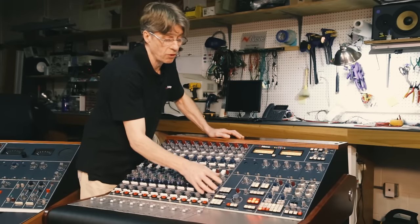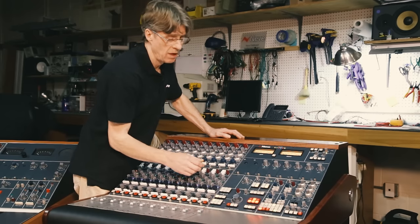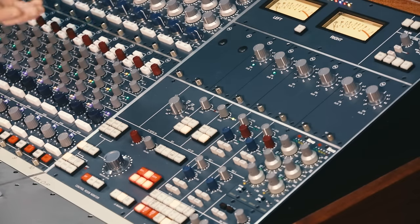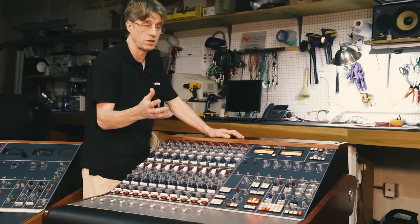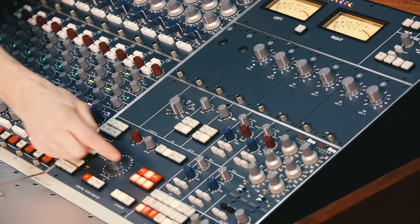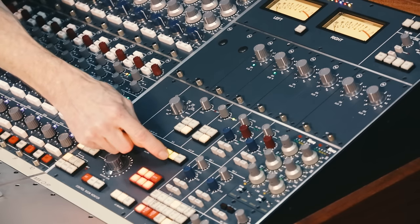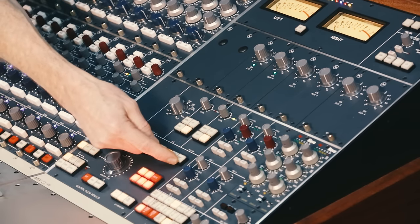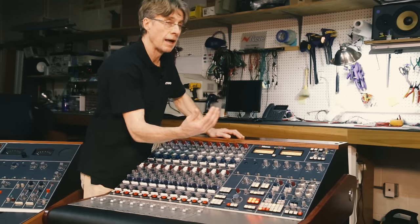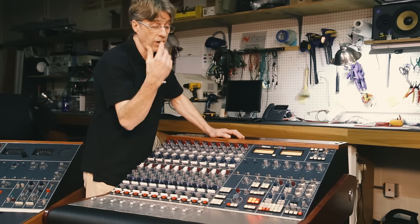Here we have the control room monitor, which can be stereo or 5.1. The 5.1 mode is for playing back 5.1 mixes done in the box. You've got the 5.1 mode button, which enables the cuts and level control. You can place an 80 Hz filter on the sub output, and there's a swap button where the LS and RS rear loudspeakers can be swapped onto the front loudspeakers to balance them up, then put back on the rears to judge how the mix sounds.